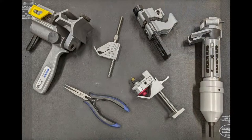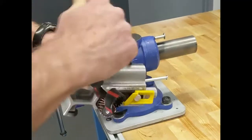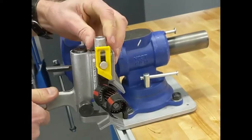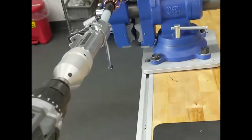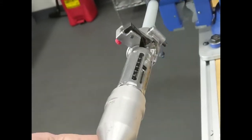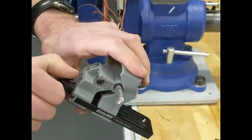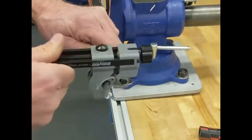Today we reviewed a number of tools with a focus on the SCS, but Ripley also offers a wide selection of tools such as the WS-64, which is what we used to prepare cable for the demonstration — a great tool for JCN underground cable jacket removal. We also offer the bushing-based WS-5 platform, which can be operated in drill mode for multiple cable diameters, and we also have the chamfering tool, the US-10 platform, which makes quick and precise chamfers on EPR and XLPE insulations.